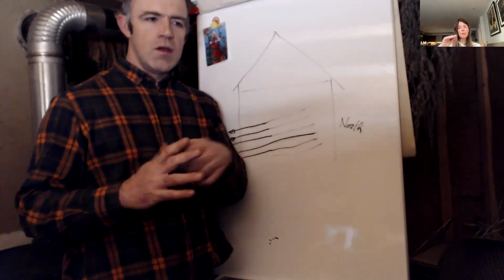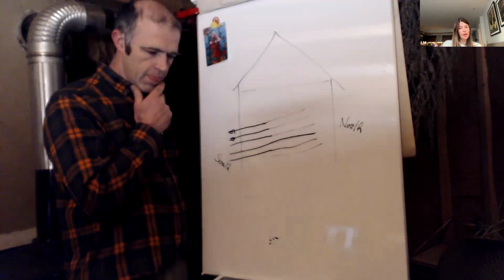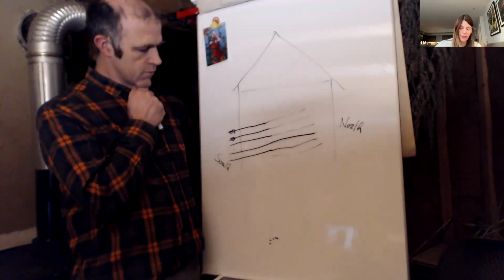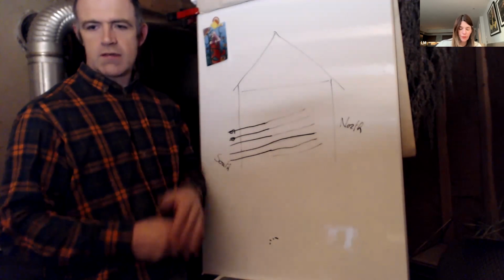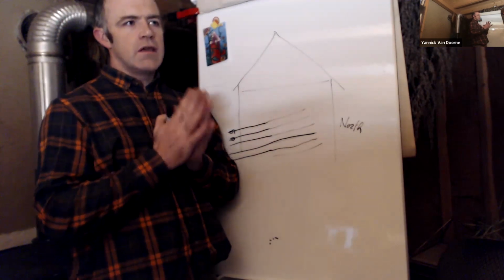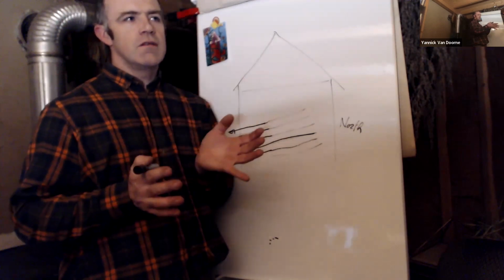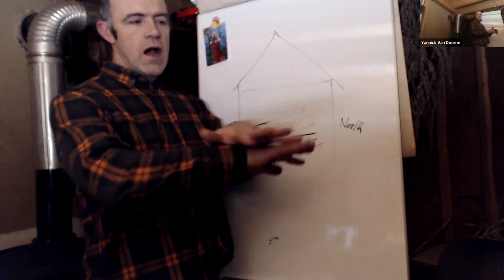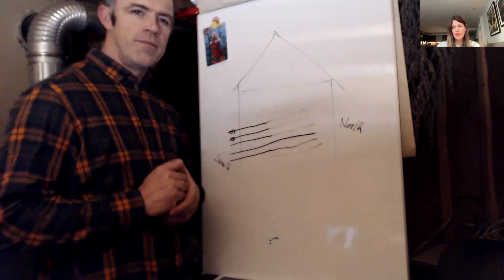And essentially before you put the first layer of concrete down. Yes, it's best. Okay, got it. That's really an important point. Yes, if you really want to make the best of it, then you put it in the concrete and connect it also with the iron in the concrete. Terrific. That makes a lot of sense.